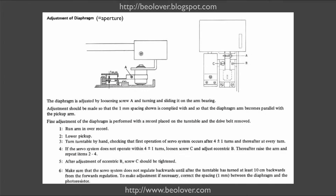Now it is time to adjust the aperture position. Whenever the light source is changed in the tracking sensor, the position of the light source is a little bit different from before. That changes the entire setup because the light takes a different path through the aperture and hits the photoresistors in a different way. That means the mechanism can either get too sensitive or it can react too slowly.